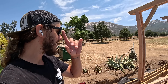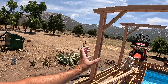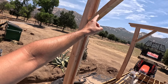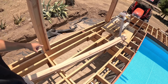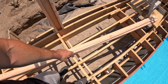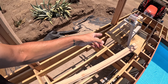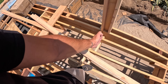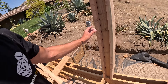Got some changes. In thinking of ways to stiffen everything up, I decided to wrap them in some 2x6s. I was actually going to wrap the entire thing and bulk it out to look like a 6x6, however I kind of like the look of leaving the centers open — it matches the openness of the 2x6s running across the top. I also put in some more bracing down below to hopefully keep this entire thing from wanting to twist or rack. The other side got similar blocking, and she is significantly stiffer than she was.